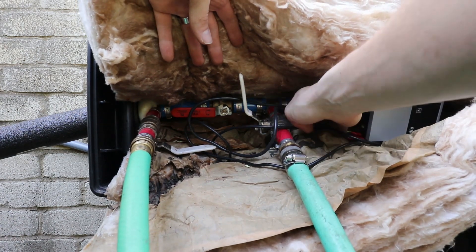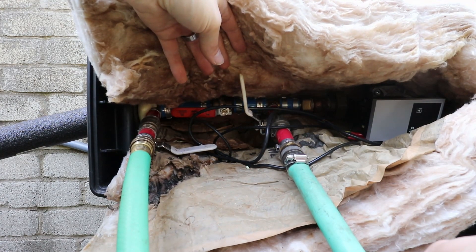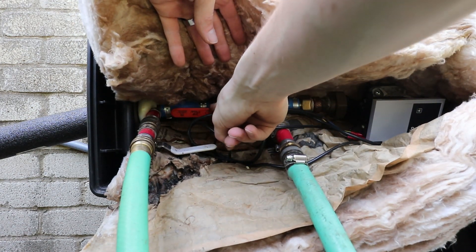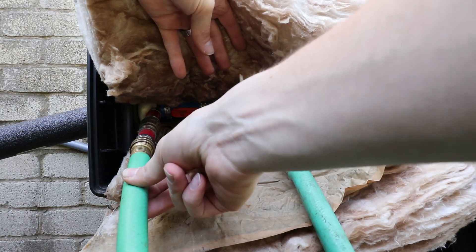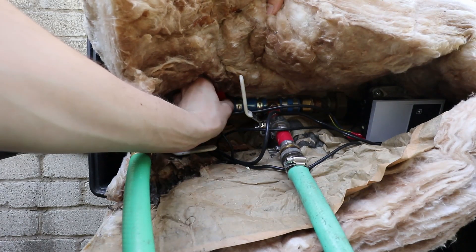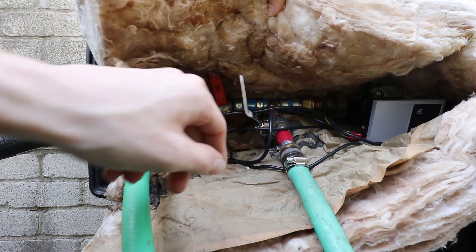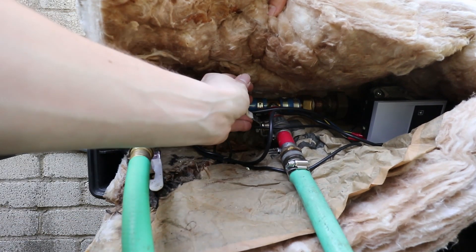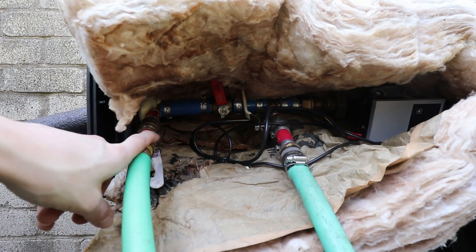You've got from the Chiltrix unit through this pump, then a three-quarter inch line with a ball valve going to an output straight to my bucket, and then a one-inch ball valve followed by a T with a three-quarter inch ball valve going to my pump. I'm going to close this valve so I can pressurize this side and have everything come out the other side, then open these two up.